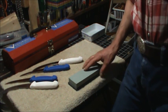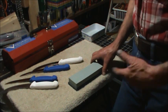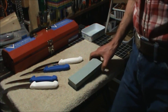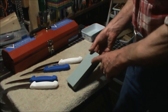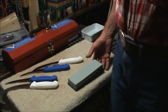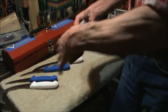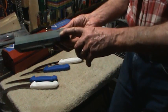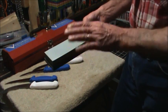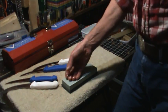I'm going to show you what stone I use and how I do that. I only use stones — I don't use a machine to sharpen knives. Here we are in my workshop down in the basement of our house. What I like is a wet stone. Brands don't matter — this happens to be an Edge Logic, but brands don't matter. What I like is fine stones. This one is a 1000 grit and a 400 grit, which I don't use. I only use the 1000 grit.